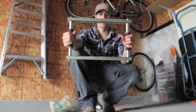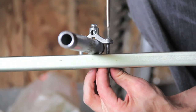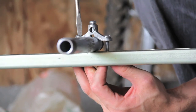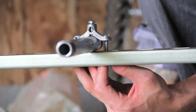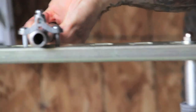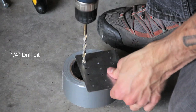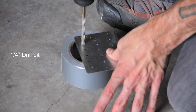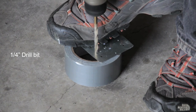Here's what the main structure of the fig rig looks like. Next you're going to take your third 8 inch or 10 inch steel pipe for your handle. I'd recommend using a shorter one, maybe 6 to 8 inches — 10 inches might be too long. Next you're going to take a 4 inch by 6 inch steel plate and drill a hole in two sides of it so we can fit our quarter inch bolt through it and attach it to the shelving structure.